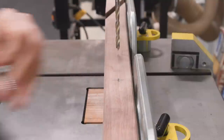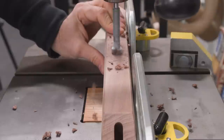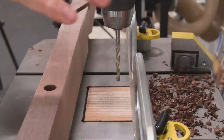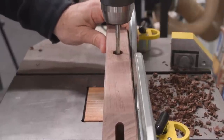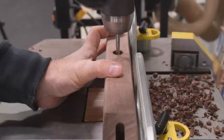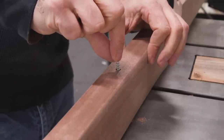On the bench, we're going to be a little more no-frills for attaching the top with screws. I just counterbore deep enough to allow the four-inch screw to bite into the top. And then after that counterbore, I can continue to pre-drill a clearance hole all the way through for the screw. That hole is oversized and allows the screw some wiggle room for wood movement.